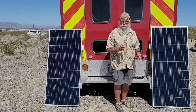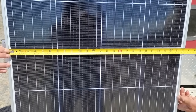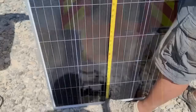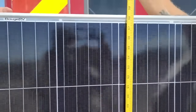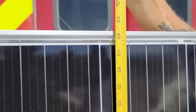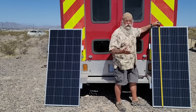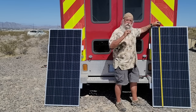But you do have to think about it when you buy a solar panel. First thing you do is measure. This one is 26 and a half inches wide, so you need a space that's 26 and a half wide and 58 and a half long. I'm running these in series so I can use a smaller wire and have a longer run - the controller works more efficiently with a higher voltage. It's called overhead: it gives more room to manipulate the voltage, the more voltage there is.